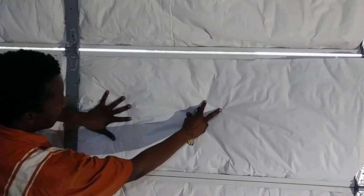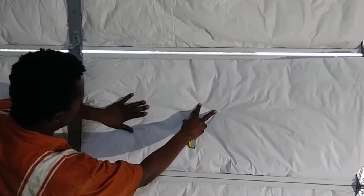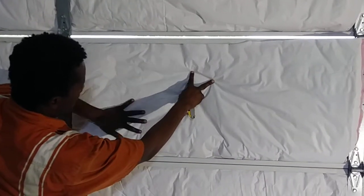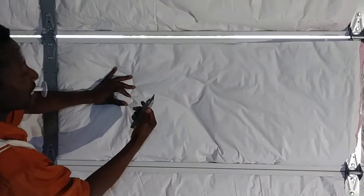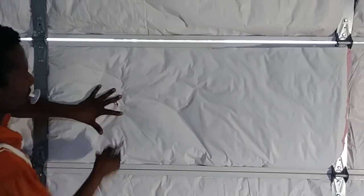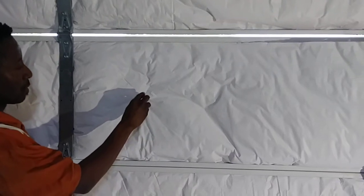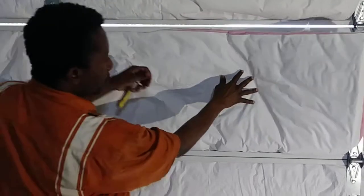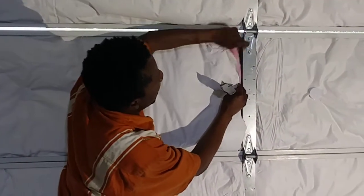Now I don't press down here, but I just kind of move it so I can have a little bit of the insulation here. So see here, I feel it, and then I cut. Just like this. You see, right out, and then I merge them like this. See now, it's not going to go anywhere. So I go here and do the same thing.